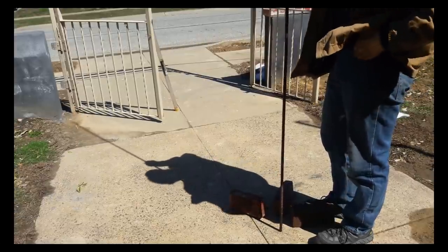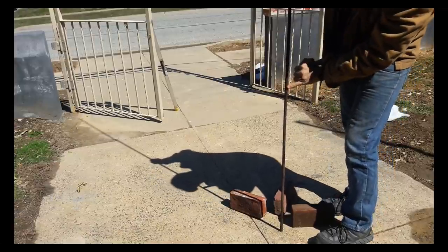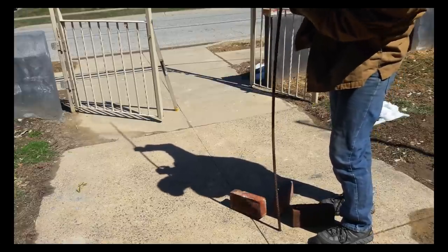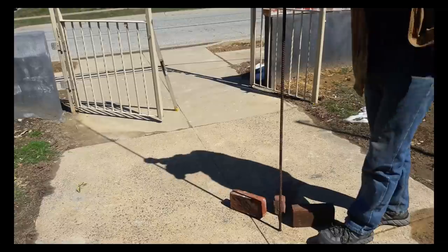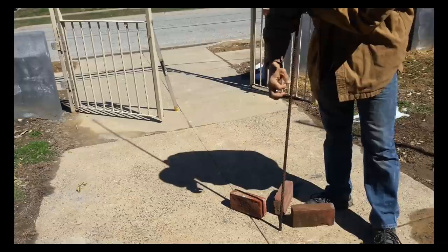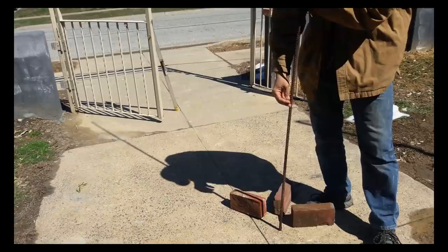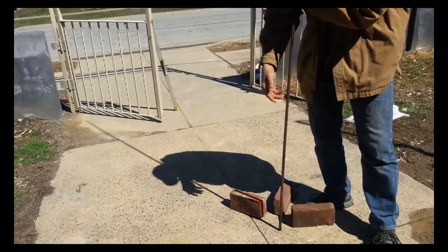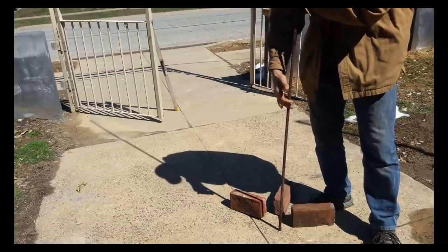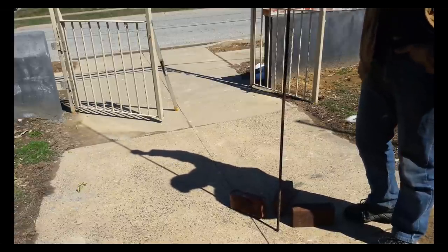Once you start tensioning the cables, this will not compress, this will buckle. And when it does that, it can help burst out the backside of the entire column. And what you saw in the video, the column does have a number 8 piece of reinforcement or greater there, 1 inch, and it left a beautiful pocket just where the cables were located.